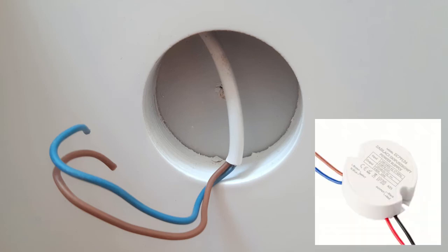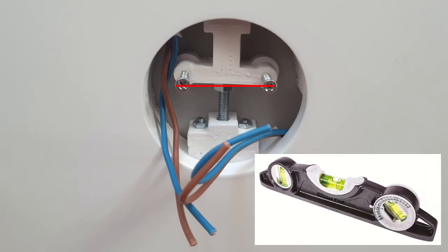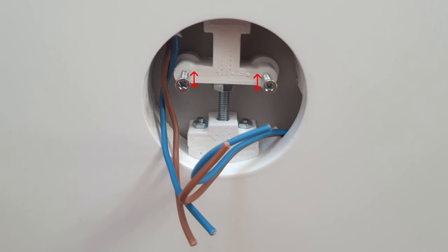The carpenter put 0.5 square millimeter cable inside the stairway. First I connected a 12-volt power supply to that cable. Then I removed the outer insulation and put the plastic holder inside the hole. I twisted a nut to spread the two endings — in that way the item holds tight inside the hole. During that step I used a spirit level on the protruding screws, and I recommend finding the proper length of protruding bolts. Put the printed light and check it adjoins the wall; if not, adjust the bolts and repeat until it is fine.